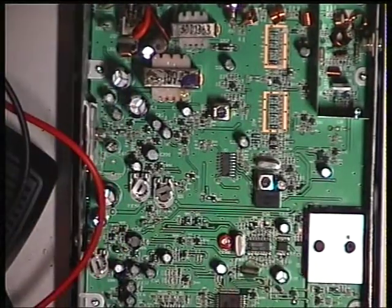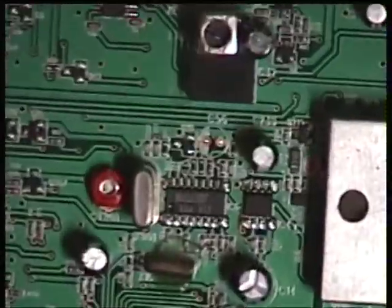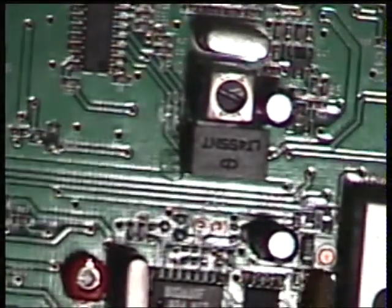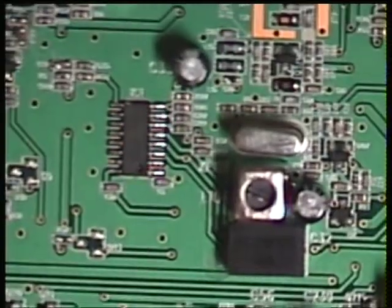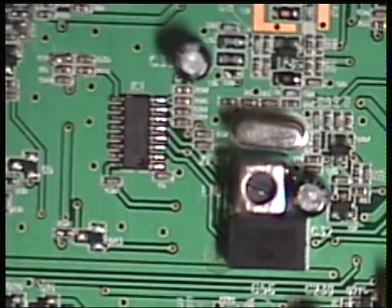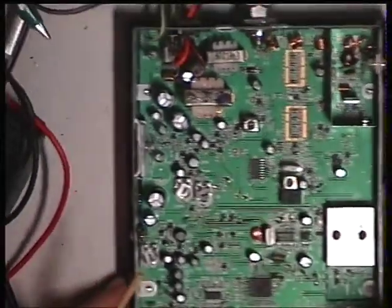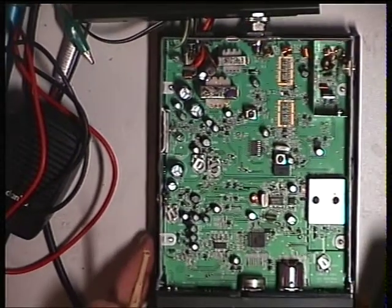Is it numbered? I'm zooming in on it. It's just under the shadow of the can there — see that shiny point? That is the test prod point. And whilst we've got it zoomed in that far, that is the FM detector — we'll be coming into that in a moment. It's all surface mount on a fiberglass board, as I say. Looks nicely made. It's a basic set and I'm sure it does what it says on the tin, which is what we're just going to find out.